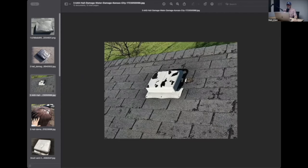This here is a plastic turtle vent with holes all the way through it. They may or may not have a leak upstairs. This is so close to the ridge that the only water getting in is going to be whatever raindrops fall straight down into that hole, which even in a really heavy storm, is not as many as you think. It's probably not enough to cause a leak, but they absolutely need to get that fixed to keep bugs, birds, and critters out. Plus it will eventually cause problems.